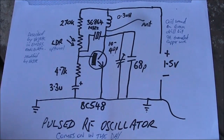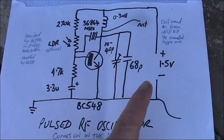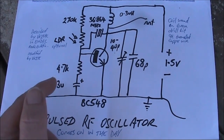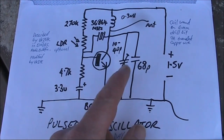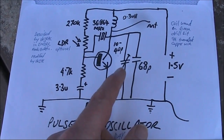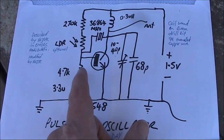Looking at the circuit, I was able to get it to successfully work with a 1.5-volt battery. In fact, it even oscillated with 1.2 volts. It was quite easy to get the circuit to oscillate, but getting it to pulse was harder. There is a lot of interaction between the trimmer capacitor — which I had in a different position in the circuit than the original, because I wanted one side to be earthed — and the frequency of pulsing. In fact, there are many positions of the trimmer where the circuit wouldn't pulse at all; it was just a continuous carrier.